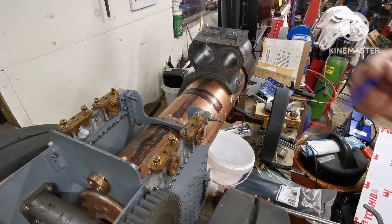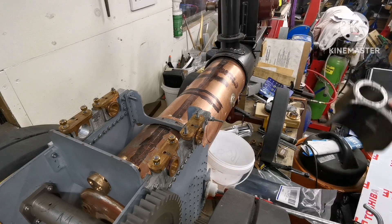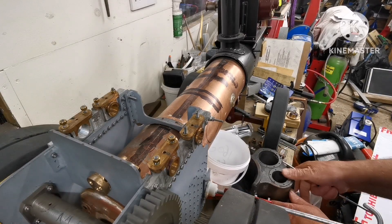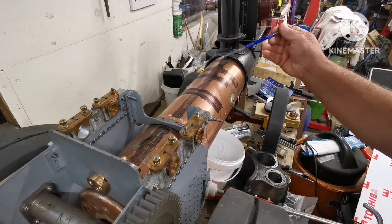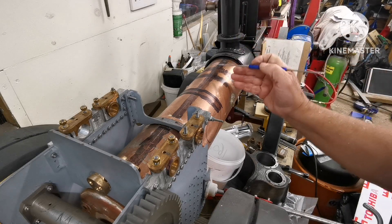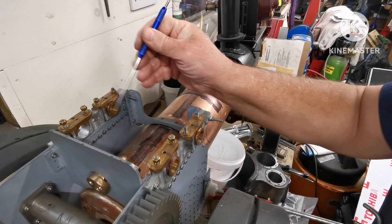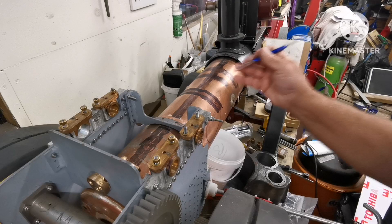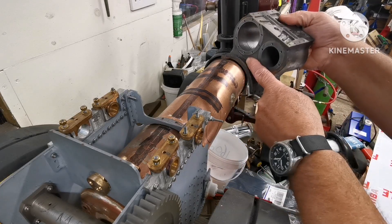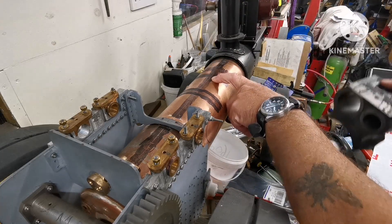Right, lovely. The next thing I'm going to do is take the cylinder block off and then I'll just recheck that measurement - which would be the center of the cylinder block. You've got the face on the drawing and it's got the measurement to the face from the center of the crankshaft, and then to that face there. I've got to allow for this flange there, which I have marked, but I'll just double check my measurements.